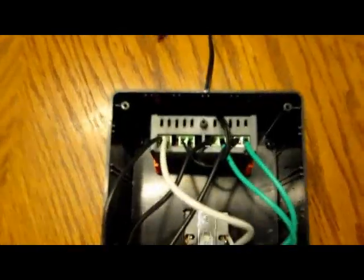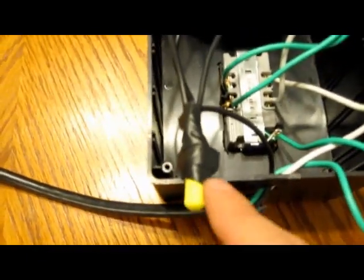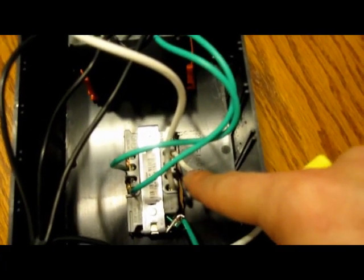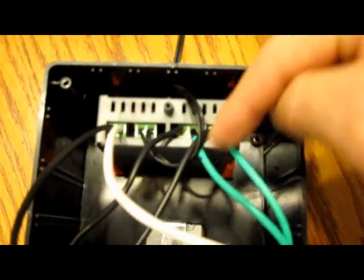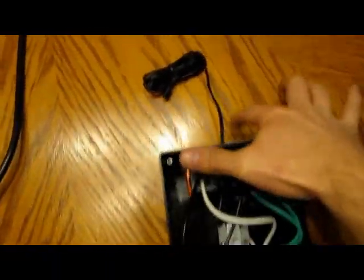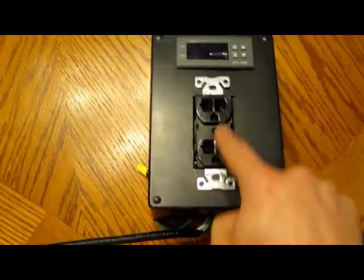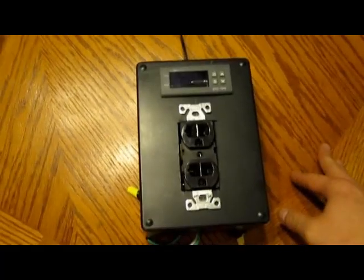She's all wired up. Here are the first three black wires tying into the hot leg coming in. Here's the neutral that comes out and goes to the receptacle; the other end comes out and ties in, and those are bridged together. Here's the hot leg that comes out when switched on, going to each individual outlet receptacle with the bridge broken. The ground for the plug ties into the receptacle. Run your temperature probe in and screw that in. Next I'm going to drill the holes for the screws, mount on the plate, put on the back, and it should be ready to run.